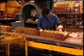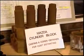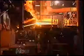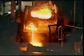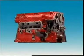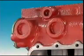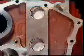The iron casting process begins by making up the shapes of what will become water jackets and cylinders as sand cores, which are fitted into moulds. This stops these parts becoming solid iron. Molten iron is poured into sand moulds that are formed by patterns in the shape of the block. After casting, core sand is removed through holes in the sides and ends, leaving spaces for the cooling and lubricant passages. These holes are sealed with core or Welsh plugs.